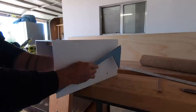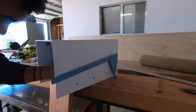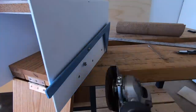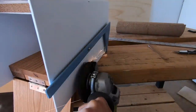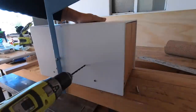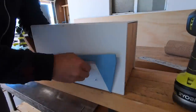I drilled a hole through the side and used a stainless steel bolt to attach the flag. I added additional bolts through the same side to create resting points for the flag so that it could either stay up or rest horizontal in its resting position. For the bottom stop, I want the flag to be able to go around the bolt but still rest against it, so I ground down the head of the bolt real flat — this way the flag can wiggle just enough to bypass it but still catch it to hold it vertical.